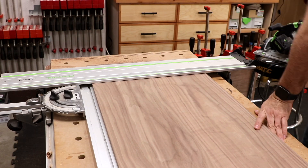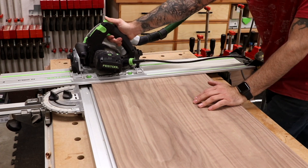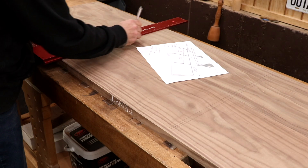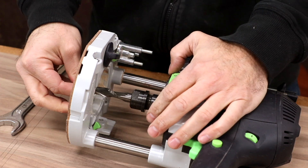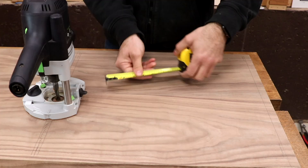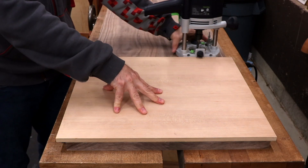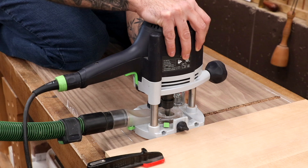When the glue dries, the surface is rough sanded and the panels are trimmed to final width. The MFT is a nice tool for trimming the boards to length and making sure the ends are square — a large framing square and a guide for your circular saw is a good alternative. Using my drawings for reference I'll begin marking the locations of the dados and grooves on the top and bottom. Because walnut is so dark, I'll use a white pencil to reinforce the start and stop points for the dados, making it easier to see when routing. All the joinery will be cut using the router and a half-inch bit. We have three more of these to do.